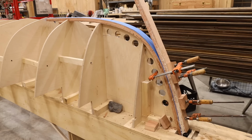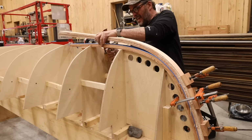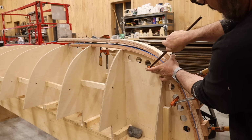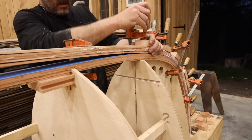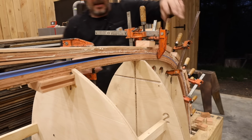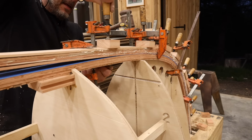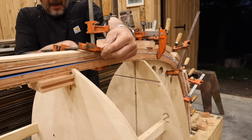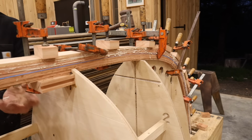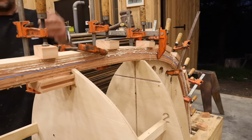And you see here I'm putting those blocks of wood on there because when I clamped, that last piece still wanted to go straight. So those blocks provided pressure across the whole width of the laminate. Because if I just used the clamp itself, it was pushing down in the middle and the wood was kind of butterflying up around the clamp. And so everything is nice and tight.